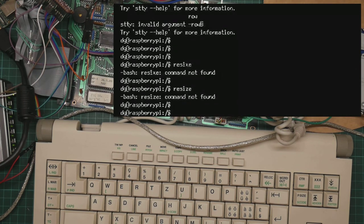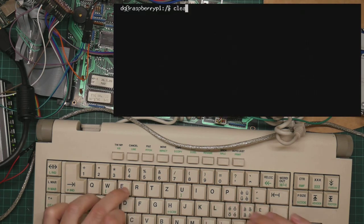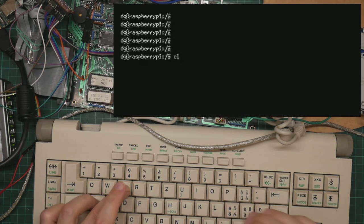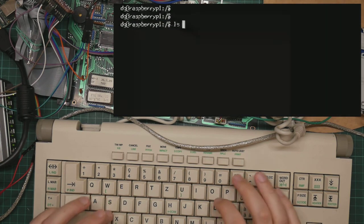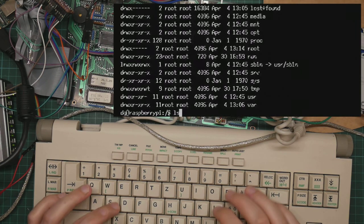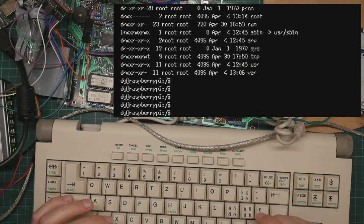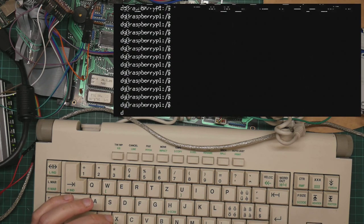Okay, so it's better. We're going to have to up the update count, but it's definitely plausible and with a reasonably steady image. No snow, even when it's busy. That's a good thing. Here it is with update rows set to 8 as it was before, and ooh, there's snow. Yeah, 8 is a bit too optimistic, but it's definitely working. Excellent.